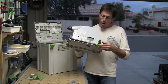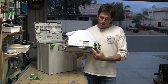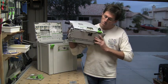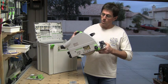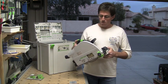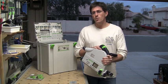There is a general problem with this, and that is, in a way, it's a recommissioned off-cut splinter guard from the TS-55 — it's the same size, in fact the same part number. The problem is that you actually have to go to a considerable plunge depth before it engages. Right now I'm down to a 25mm plunge cut, which is what you'd use on a guide rail if you were trying to cut 3/4 inch or 18mm material — so you don't have the benefit because it doesn't actually reach it. You actually have to plunge quite far in order to engage it.